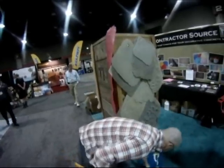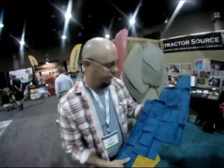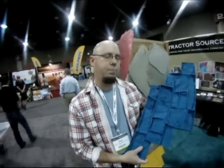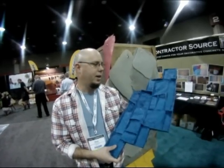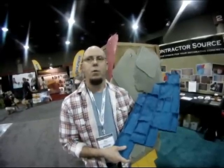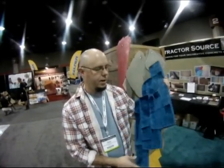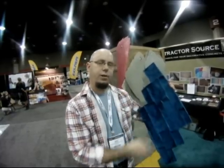The second is what we call our tight stack stamp. It avoids the grout lines which cause a lot of stamps out there to look kind of faux. The very tight joint — sometimes non-existent — with heavy relief is going to give you a very natural look. You can punch out a pattern really fast, then go in with the ledge and other various tools to doctor it up and avoid any look of a stamp pattern. Again, three different patterns, heavily detailed, totally toss and turn.